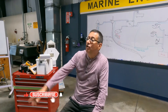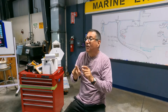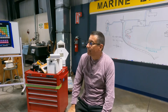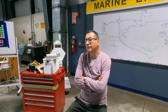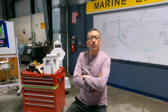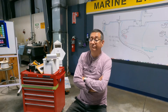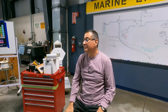When I introduce AC current in my boat - when I install a small AC panel, one air-conditioning unit, one battery charger, and a shore power connection - at that moment you need to install a galvanic isolator. So if you're using AC, correct, you need it. Before that, no. Why is my small dinghy boat not corroded and the big boat is? Because the big boat has AC power and the small one does not - the small one only has the outboard, a couple of navigation lights, a switch, and that's it.